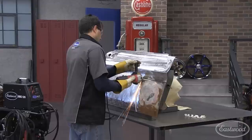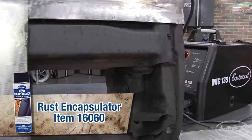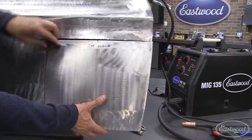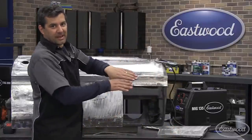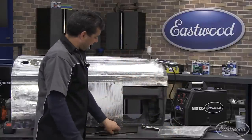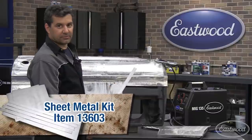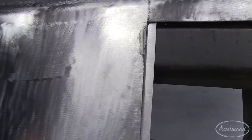Now we're back to our door. We've cut out the corroded area, applied some rust caps treating the rust behind it, and we've taken a patch. A tip to make it a little bit easier: if the panels don't line up exactly, we have the sheet metal kit that gives you these doubler strips — one inch pieces of aluminized steel — just in case it isn't cut correctly or you need to shift something as you're fitting it.